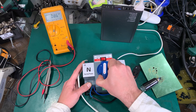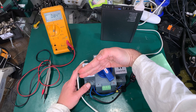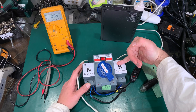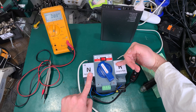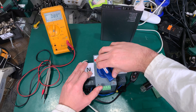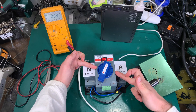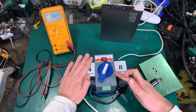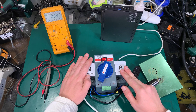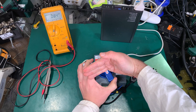If I rotate it right now, you can hear that click. There is this rod that switches one off while the second one is also off in the middle position. If I reverse this, one is going to be enabled and the other one is going to be broken. So it's a very simple mechanical interlock.